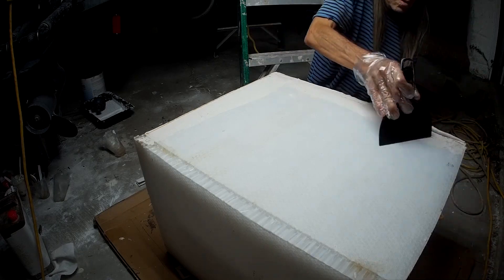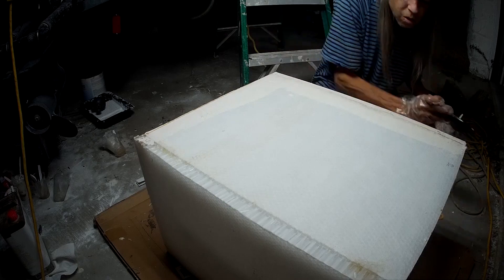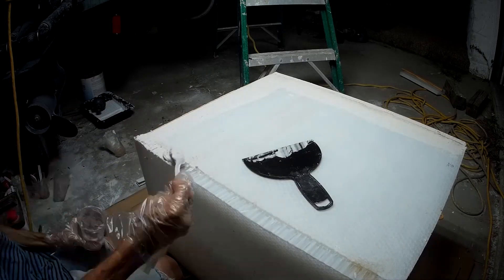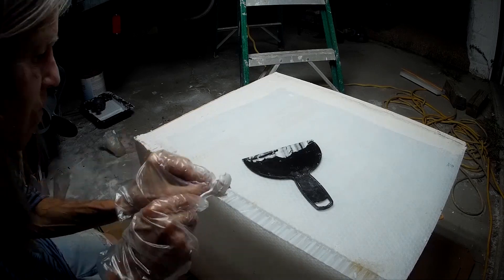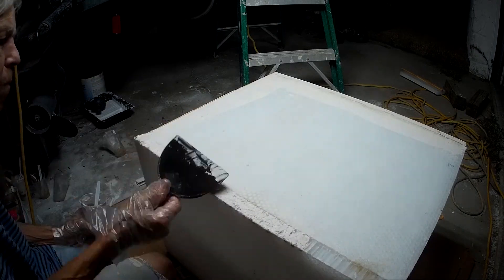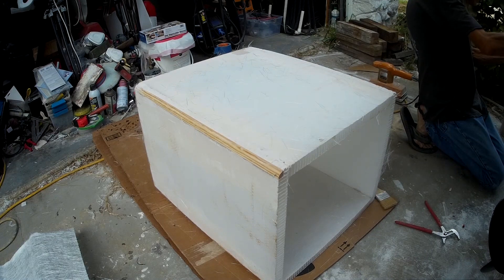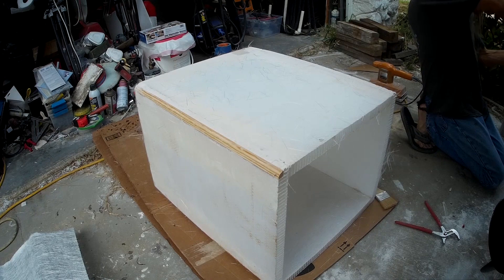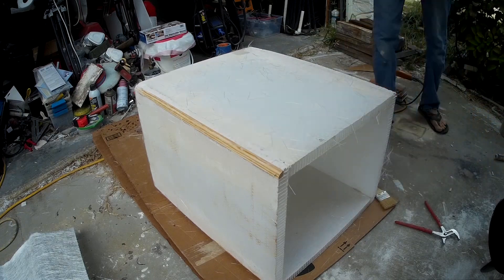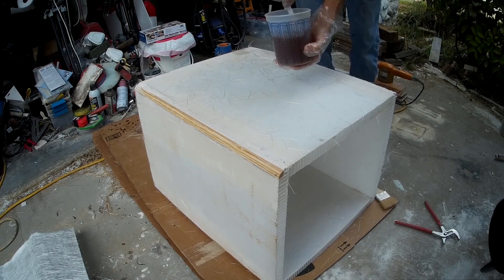The fairing compound is very smooth at the moment and it spreads easily. When I come over to work on this side it's starting to harden up a bit already and it resists smoothing. Little chunks harden ahead of the rest and leave a lumpy texture. If you run the trowel along, a lump will just drag through the smooth stuff and leave a little hollow that you're going to have to come back and fill in anyway. So when the fairing compound starts to get lumpy or looks like it's starting to harden, you're done — you're better off to just mix a fresh batch and start again.